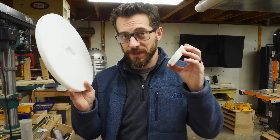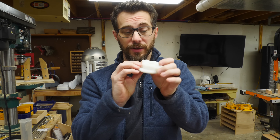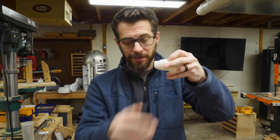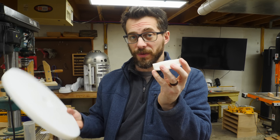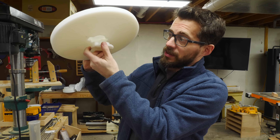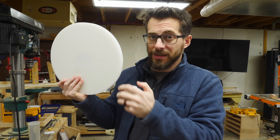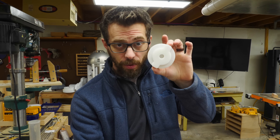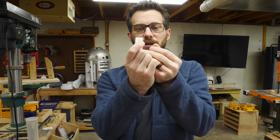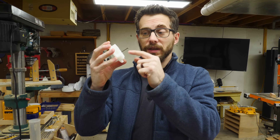Now that we've got these pieces cut, it's time to attach them to the shaft, and to do that we're gonna start with this coupler. The shaft is gonna come up through here, and to attach those pieces together, we're gonna drill a hole through both of them and drive in a nail to lock them together so that they will spin at the same time. Then on top of this piece we'll add a whole bunch of epoxy and put the bat down onto there. This plastic doesn't typically stick super well to epoxy, but because these pieces are gonna be pressed together there's a whole lot of surface area, and you're never really gonna be pulling up on this piece, so it should stick just fine. We did some tests to make sure the drill bit was the right size for the nail — tight enough that it won't fall out — for a nice solid lock between the coupler and the shaft.